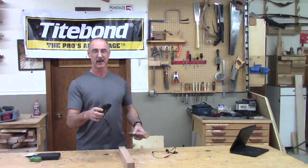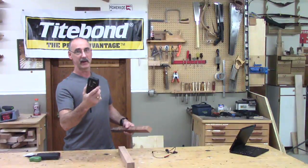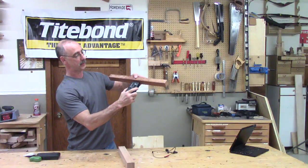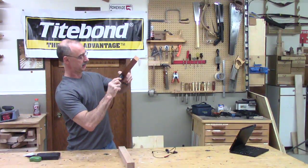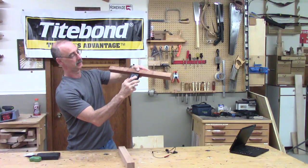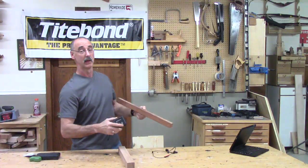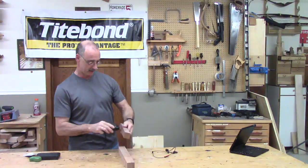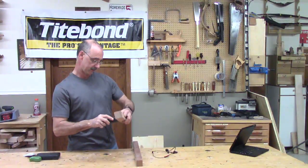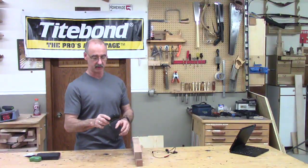Good filler. So the thing I went to get is a moisture meter, and these are a great investment for anybody who's going to do woodworking. And the deal is, when I poke it in here, if my battery's not dead, those probes are going into the material. The scale here is telling me then what the moisture content is of this material. So on your Sapele, maybe we would have done this. Let me look, I'm just going to check this one and then do this one. And these have both been in my shop a while. They're very similar in moisture content.